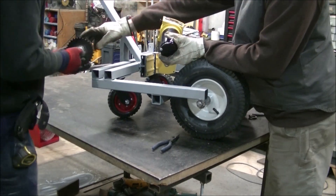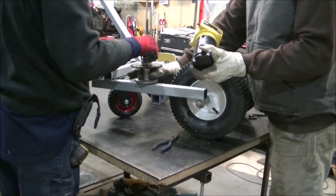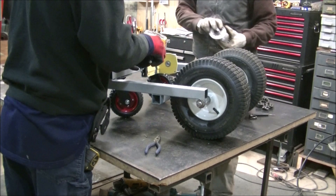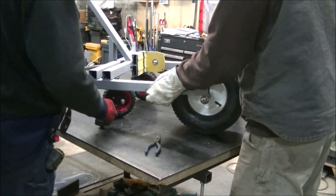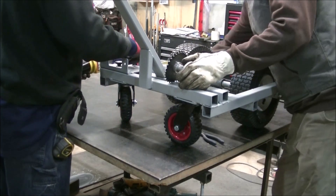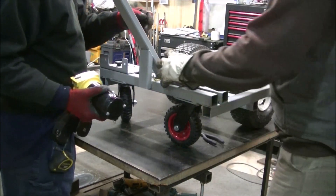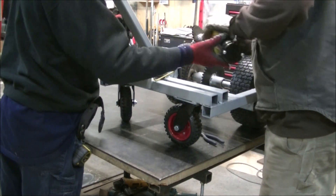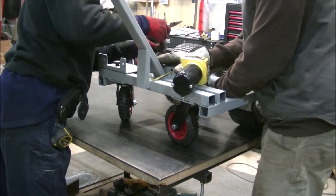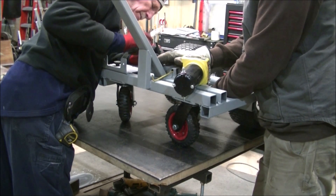The way this goes in, everything has to be put in in order because we've modified the base, so we can't put it in together as a unit - it's got to be put in separately. That drivetrain assembly will be held in place with a 5/8" washer and then a cotter pin. I'm setting the retaining pin on the drive assembly so that you can still put the gear in free spool and manually dolly the cargo.